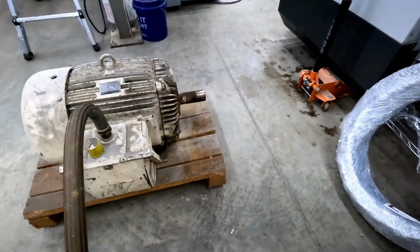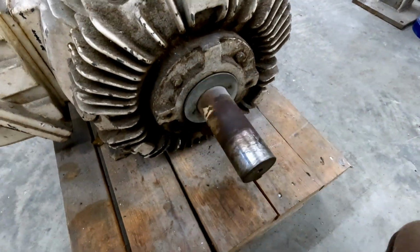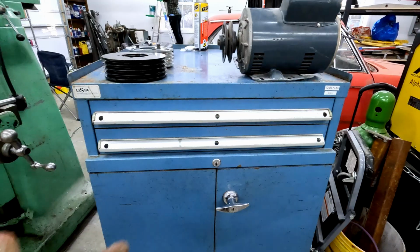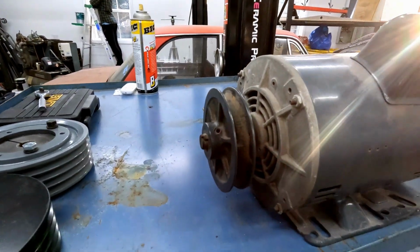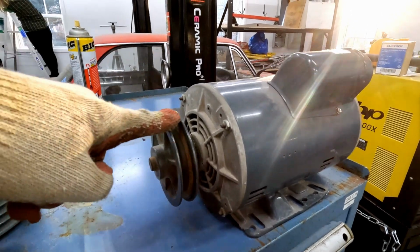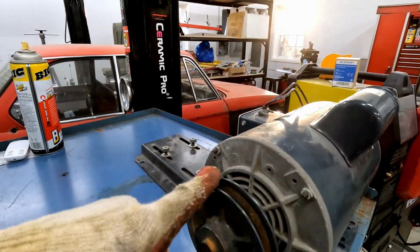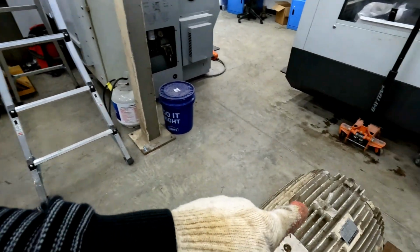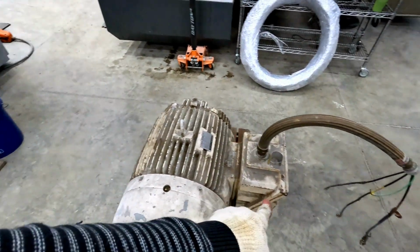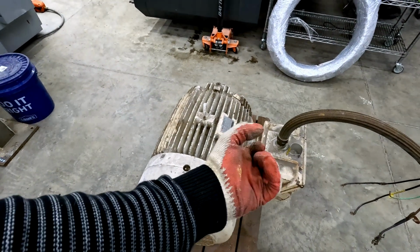Now, other than the capacitor start method, well, I guess I could just spin this up by hand every single time, though I suppose that would probably get tiring. Then it hit me. Like most garage enthusiasts, I've got a whole bunch of old motors sitting around. This one happens to be single phase, which means I can start it using the power I have coming out of my wall. And why not use this motor to maybe somehow spin this motor, and then once it's spinning, I can connect my 3-phase, and voila! I have 3-phase power, and lots of it.